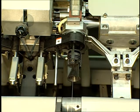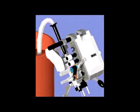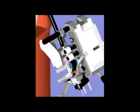the fiber is pulled into an orifice by a suction airflow created by the vortex that will perform the twist insertion. As the fiber enters the vortex zone, it is literally spun into a yarn structure by the whirling air currents.